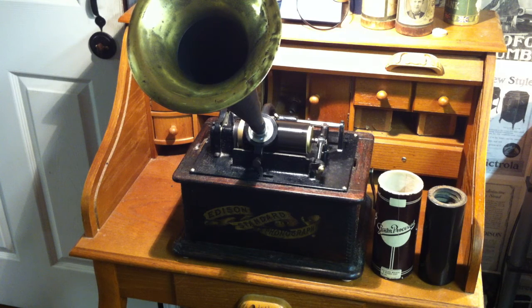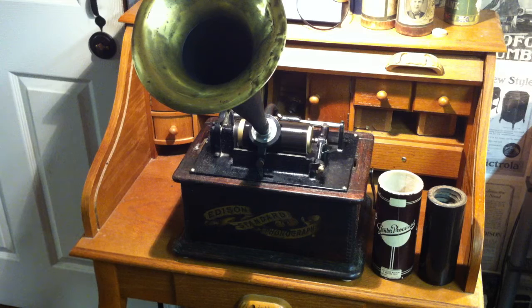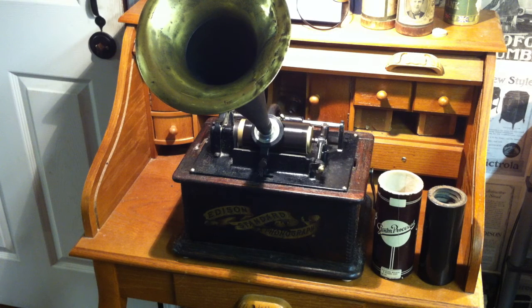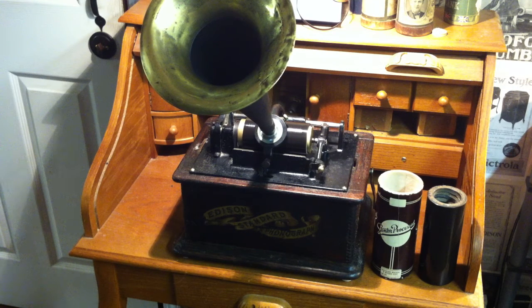They're in a brown cylinder tube, and I've never seen them before. They look virtually identical to the Edison Dictation Cylinders — black wax. I've modified them for use on the Edison Cylinder Phonograph. I've cut two inches off of the end of them to make them four inches long, standard size, and then put them on the shaver and shaved them down considerably to a dimension that's acceptable for use on the Edison Cylinder Phonograph.